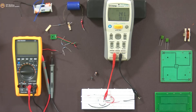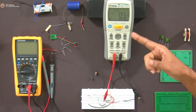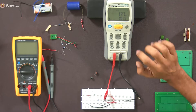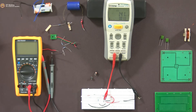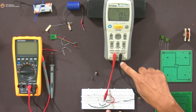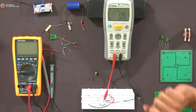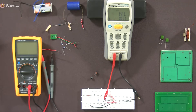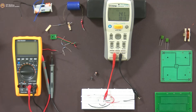To cross check, I brought an instrument that can measure capacitance. It can measure inductance also. So first we will do the capacitance measurement. I have connected this to the breadboard, and it is already showing some 1.4 picofarad. That is the capacitance of the breadboard itself — the breadboard and also the cables.